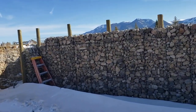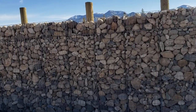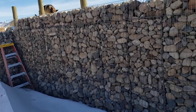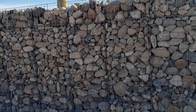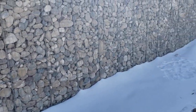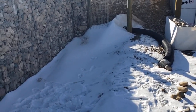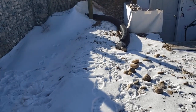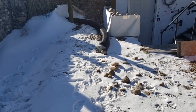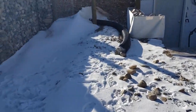Like we did this wall — this was the most difficult wall to build. It is over 50 feet long and 7 and a half feet tall; we could not find panels that were that tall, so it's like building three separate walls and stacking them on top of each other. Total height will be 7 and a half feet because it's down inside the cold sink, which is about 2 and a half feet deep. This will be a bearing wall. If you look here, you can see the shadowing — our calculations were very good. The cold sink, you don't care if that's in shadow. But your grow floor, you want to get all the sunshine. We're at about 20 to 4 in the afternoon and you can see a lot of sunshine on the grow floor. Cold sink's in shadow — that's fine.